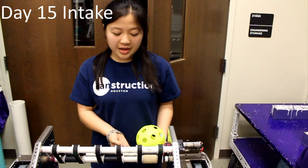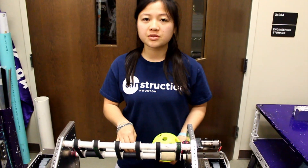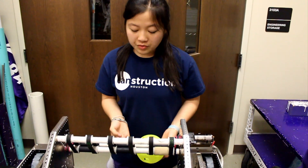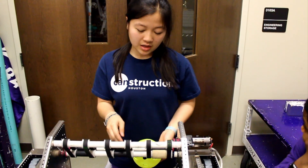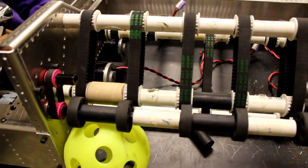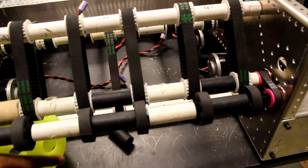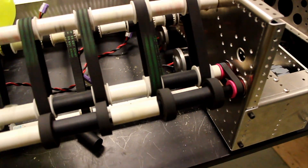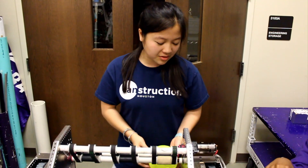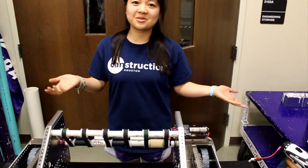Previously we had the problem where our spacers would roll along with the ball and they didn't have a lot of traction with it, so we added some surgical tubing to see if that would work. We figured out that the flanges of the pulleys touch the ball before they actually touched the surgical tubing. Then we randomly saw some gum rubber tubing and thought we'd try that — they seem to fit perfectly well, and it works pretty fine.